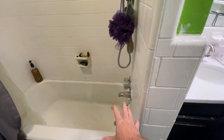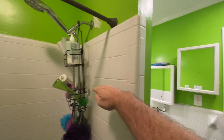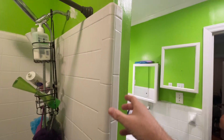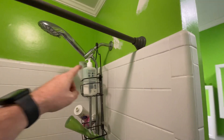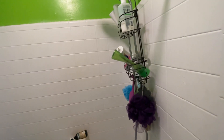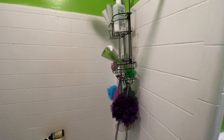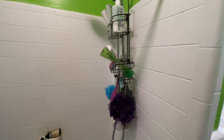This tub right here goes away. We want to cut this wall down here, and put a piece of glass — like a glass panel — right here. This shower is going to go up to there with a rain shower overhead. All of this needs to be tiled with concrete board, not plywood.